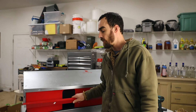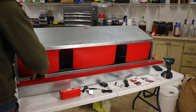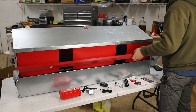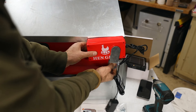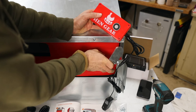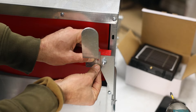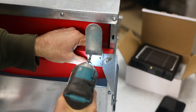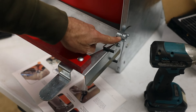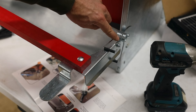You'll have to do less cleaning if you put the roosting bars up at night and lower them in the morning so chickens can go inside to lay their eggs. First, I'm going to loosen these hinges a little bit so it'll release a lot easier. The timer will release the magnet in the morning — this will pull away and fall down, flush up against this side and then flush with the bottom. Be careful not to overdrive the screw and strip out the hole. Make sure the spring splits the hinge right down the middle.